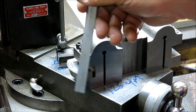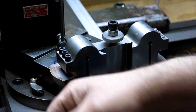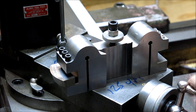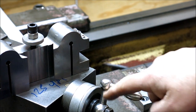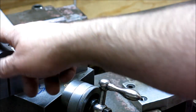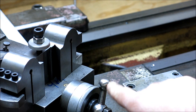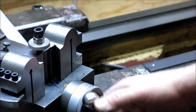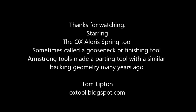This is good if you have a big form tool that you want to use. Say you want to make a whole bunch of knobs or something like that — you can make a form tool that has that form and just plunge in and cut it in one shot. That's the kind of stuff you can do with a spring tool like this. This would be very difficult to do in steel with a normal tool post. Thanks for watching.